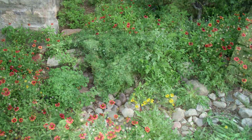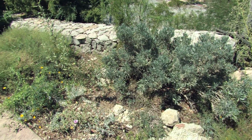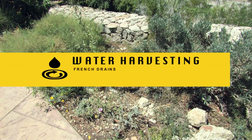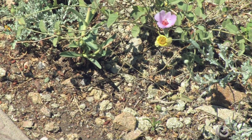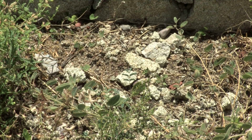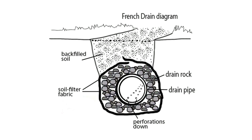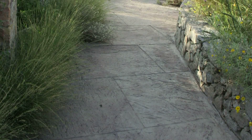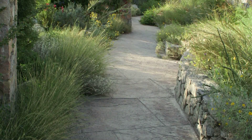The other thing that we do, visible here in the habitat gardens, is that we water harvest throughout the gardens. No water runs off the surface of the garden in most of the areas. We collect every bit of rainfall that we get, and we do that largely by two methods. One of them is French drains — drains that go underground and then radiate out in perforated pipes, and that water is allowed to soak into the soil deep underground.